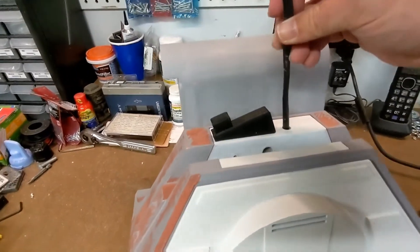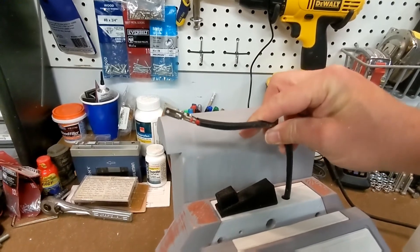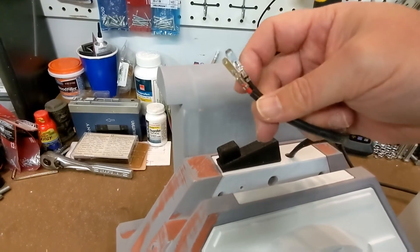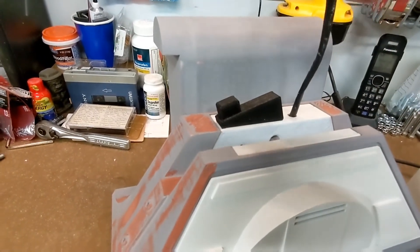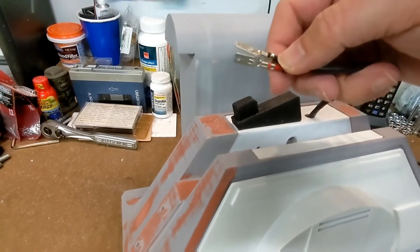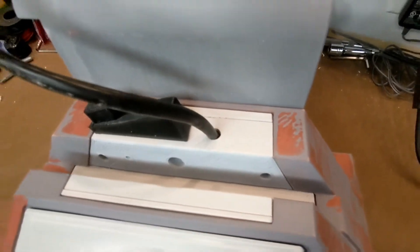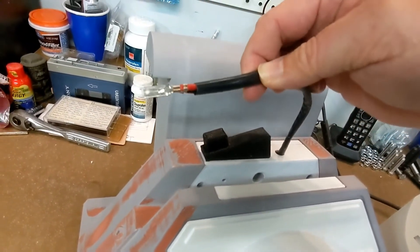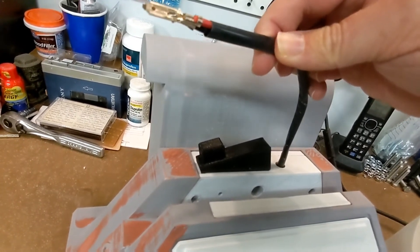The thing to keep in mind is make sure you orient your motor enough that you have enough cable to make it all the way through the ankle. The other thing is connectors — I'm probably going to go with some form of bullet connector, something very narrow and low profile so that I don't have to completely remove the connector. It's a pretty tight fit going down through that hole. I might still have to take the outer insulation off and split these two wires completely in order to be able to take the foot off and the motor at some point if needed.